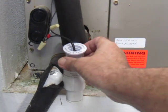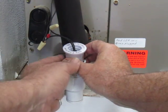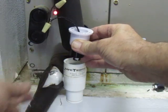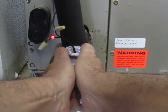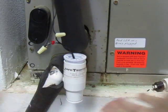I wanted to know in case I had that problem, so what I did was put a LED between these two. When it's normally working, all the voltage runs between the switch. If the switch is opened, the voltage can go through the LED and tell me that I've got a problem — that my system is backing up — hopefully before that's why my air conditioning isn't working. In normal operation, it just sits here just fine.